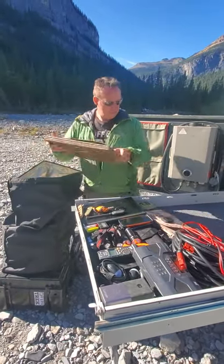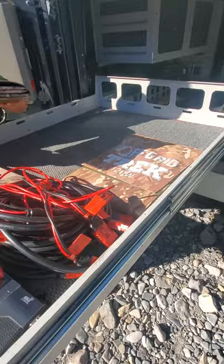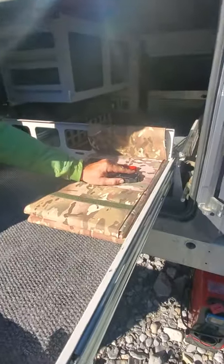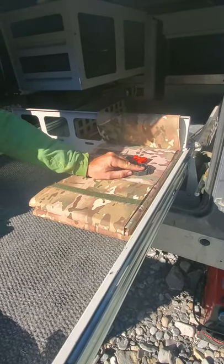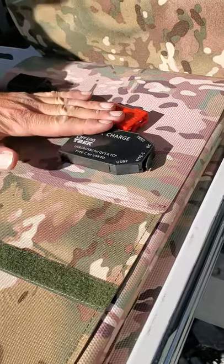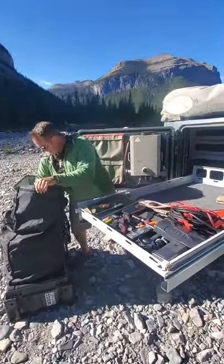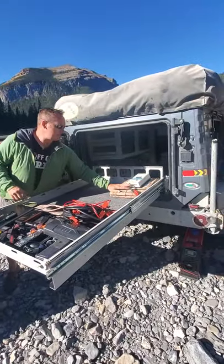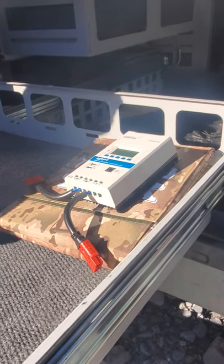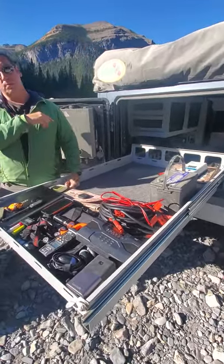Here's the solar: one of our 120-watt solar blankets, and here's another. I normally have two of these — the bonus is they're 7.9 pounds each. Both have two high-speed USB charging ports and USB Type-C, so this laptop and both phones charge from USB Type-C directly. I have all the cables to connect to your Anderson SB connector for charging the bigger devices. There's our MPPT solar charge controller, so if I want to charge an additional battery pack — there's one right there — we can charge that or the Group 31 battery in the vehicle.